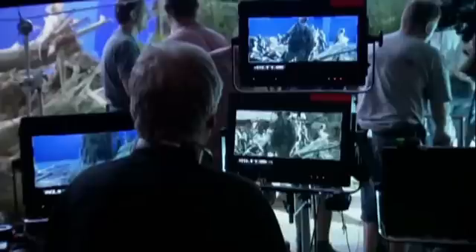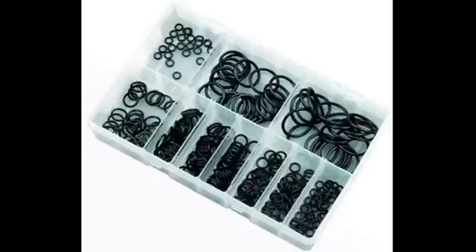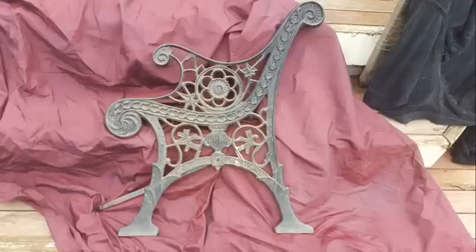Now while it looks great, it's not without its problems. Firstly, I have a couple of leaks — at both ends of the Black Ridge hose — which means air is coming out of both Nitto connections. I tried the old workshop trick of putting an extra O-ring in there, but it only stopped one of the leaks. Problem number two is that the compressor runs out of puff really quickly. At around 90 PSI, you'll get around 30 seconds of waving the gun around before you have to stop and wait for it to recharge, which can take close to a minute. With a project this size, that's going to be a lot of breaks.